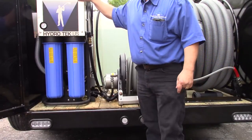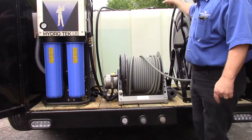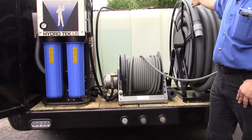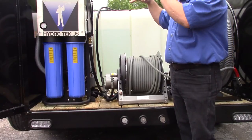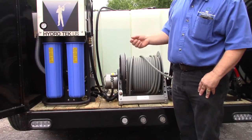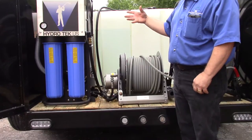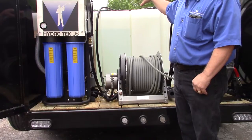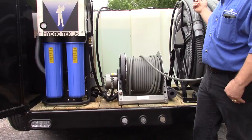This is a six-stage wastewater recovery and filtration system — we can recycle and reuse the water. The tanks are set up so one is dedicated as the supply tank and one as the recovery tank. But on top of that, you can open the valve to combine them for 540 gallons of supply tank capacity. If you're doing a Walmart storefront, sidewalks, or anywhere without heavy mildew or debris, you can recycle to both tanks, giving you 540 gallons of supply and recovery water to extend your time on site.